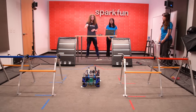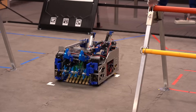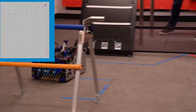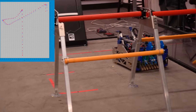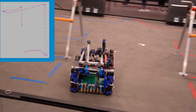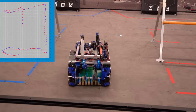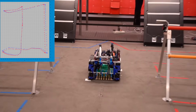We'll start the robot in the center of the field, which is the origin, then drive it around and see how far the coordinates are after we bring it back to center. All odometry solutions like this will lose accuracy as the robot moves. The sensor itself has a rated accuracy of 3 to 5 percent for the optical sensor, although the firmware on the microcontroller has a calibration that can bring the accuracy within 1 percent. What that means is if you drive the robot around some closed path that returns to the starting location, the measured coordinates should be within 1 percent of the total path length. It's not guaranteed, but it's pretty typical based on our testing.